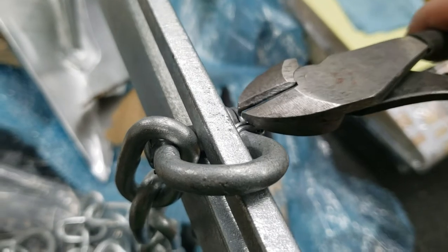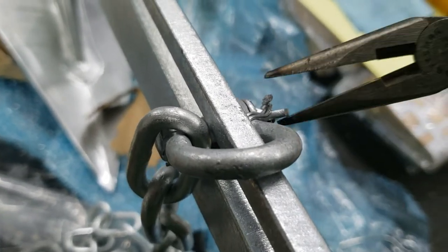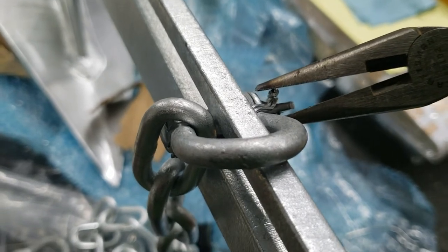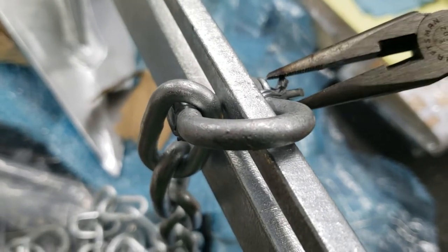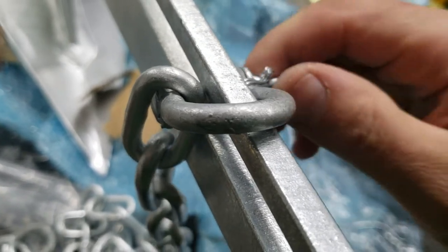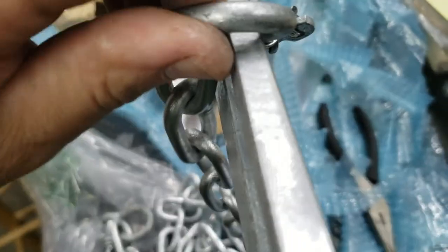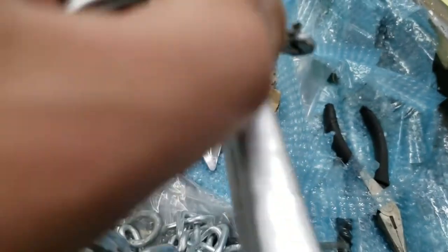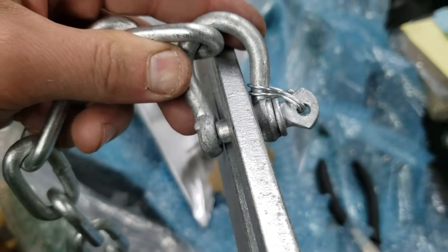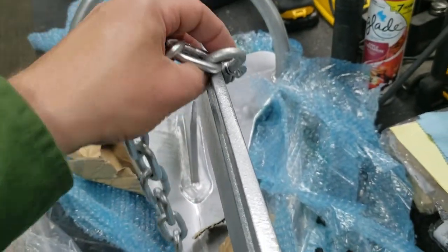We have a little bit of rock down there. We have a lot of heavy sand and heavy clays in the bottom of our lakes around here, and when I get up into those 10 to 15 mile an hour winds, the big Tahoe pontoons kind of get lifted up — especially if I've got the canopy up — and it really pulls on that anchor. The typical river anchors just don't seem to hold. So I want something a lot stronger, something that can really dig in better.